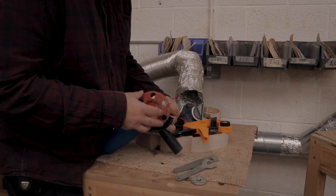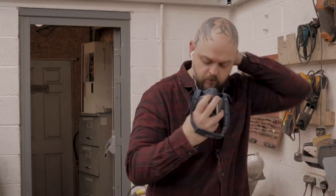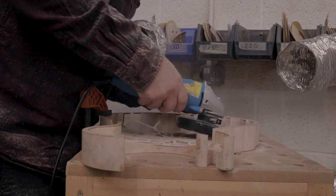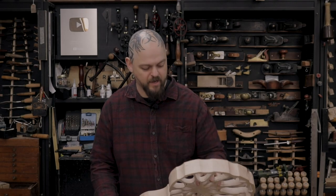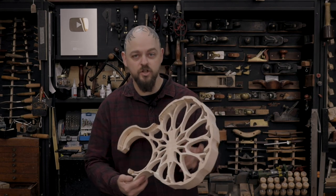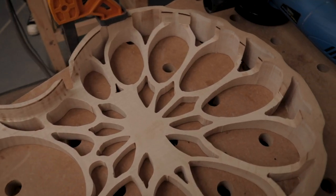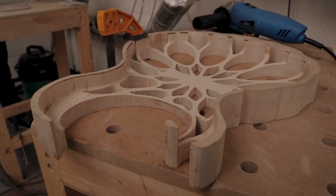And as such, I am moving on downstairs. I'm going to grab an angle grinder with a saber-tooth cutter, a fine saber-tooth cutter. The larger ones are insane. I'm gonna carve away the internal carve of this. It's not gonna take that long. It's gonna be very dusty, but a little bit of dust for a quick payoff is worth it. And the thing is, you can be very gentle with those machines, and I'm less worried about the angle grinder ripping out and grabbing a chunk and breaking something than I am doing it by hand, which is weird.